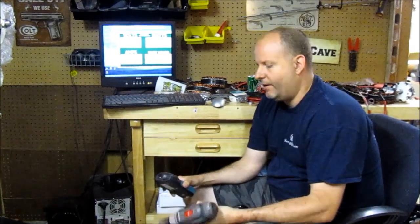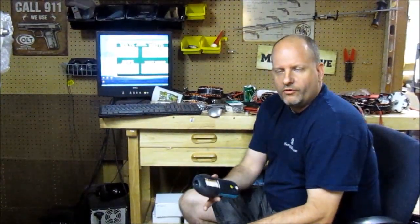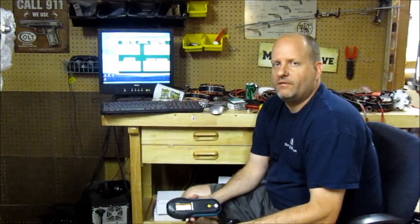I have a tachometer and a drill that's marked so we can get an idea of what the cut-in for this would be. In low wind, around 150 RPM, you see a lot of manufacturers trying to get it to come in in that area because there's more power available in higher winds, but if you don't get that kind of wind speed on a regular basis, the turbine sits there idle. When we get into a higher wind zone, it's appropriate for the turbine to cut in at a higher RPM.